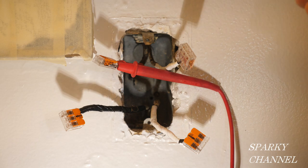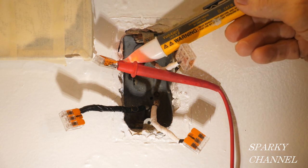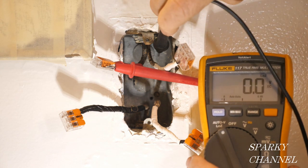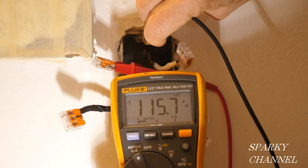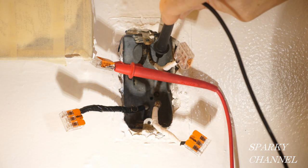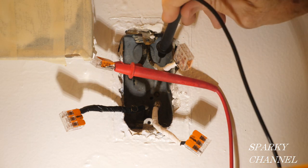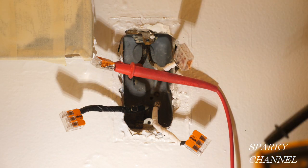I've turned the circuit breaker back on and we're protecting ourselves by having wire connectors on the ends of the wires. This is our hot line wire right here. I have one probe connected to this Wago lever nut on the hot line wire and another probe on the metal box — it reads 116 volts AC. That tells us this box has a return path to the panel, which means it is grounded. It's a 1957 method of grounding where the grounding wires come back to the back of the box inside the wall — that's the way they did it back then, but it is a ground.